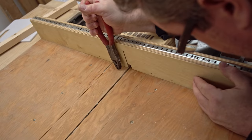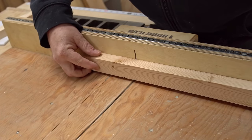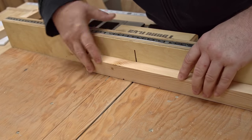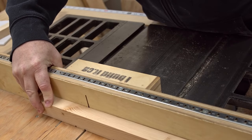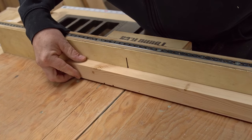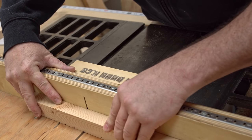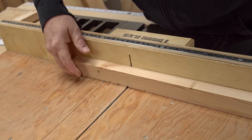To space the slots I've put a pin in the base of my sled, and that'll allow me to index that first cut on that pin. I'll make a forward cut and then move it over against the other side of the cut and make a backwards cut to clean it out the same size as the original slot, and I'll do that all the way along to the other end of the bar.